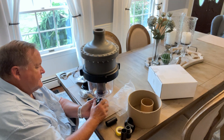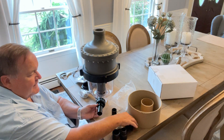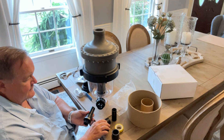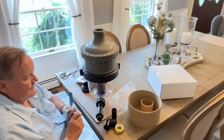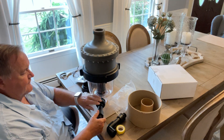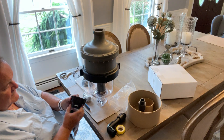There'll be some kind of piping coming off of that. I don't know yet — a couple of slip fittings — okay, I got it. So it'll go like this: the valve goes on here, then this, then this valve, and that'll point down to the ground. So this will be up top — your clean-out setup. You just take it apart like this. On the bottom union, you're going to screw in — you'll be plumbed with two-inch pipe coming off of your pump.